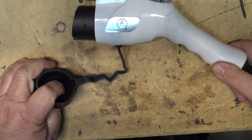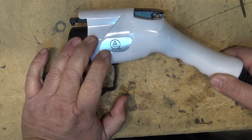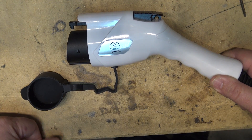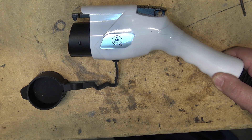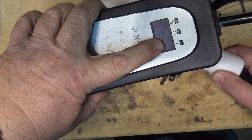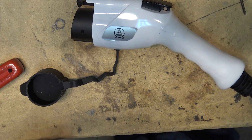Internally it's all sealed up nicely with good strain relief and heavy cable — I like it. I'm able to charge at 3.8 to 3.9 kilowatts, which is actually a higher rate than my other one which was only 3.6 kilowatts. This is 16 amps versus the 15 amps it replaced, and I do get more power from it. My original Volt only has a 3.3 kilowatt charger so the display only goes up to 3.3 kW with that car, but when I plug in the new Volt it goes up to 4 kilowatts and charges about 30 minutes faster than on the original charger. Thanks for watching — we'll catch you in the next one.